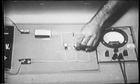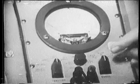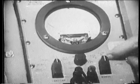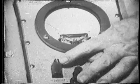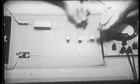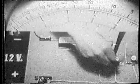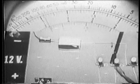Next, let's try the voltmeter. Since the applied voltage is felt across each branch, we'll have to use a range that will measure the applied voltage. And in this case, we'll use the 50-volt range. Of course, the function switch is on DCV. Okay, I'll connect the meter across the center branch. And as always, when using a voltmeter, you must observe polarity. So I'll go directly across the bulb socket.